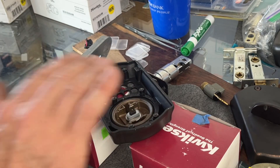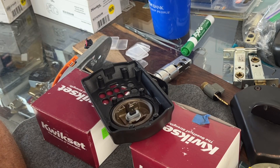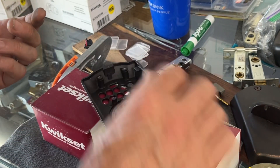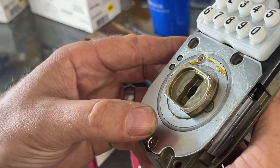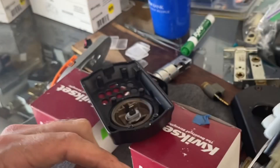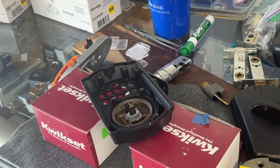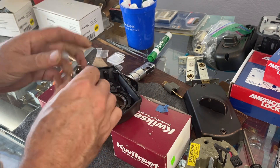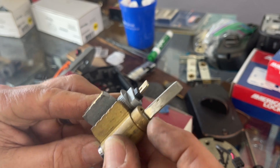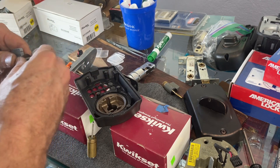The reason why we can't use a six-pin is because that would stick out too far. You might say maybe you could trim the tailpiece and do something, but not really — it'll stick out. No matter what, this guy has to intersect with that. If we tried using a six-pin cylinder it would just stick up way too far. Let me grab one to show — if we took this out and put a six-pin in, it would just stick out too far. Everything would be pushed higher. I'm pretty sure it's not going to work, but should we try it?